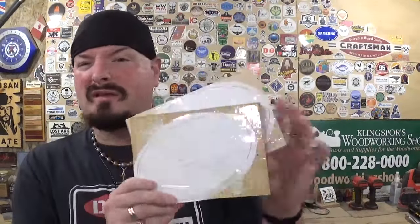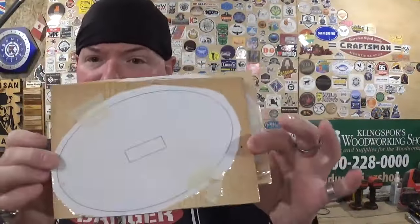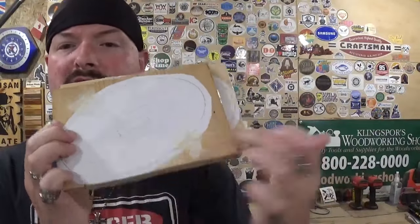The design is simplistic in nature and you can easily get out in your workshop or garage and knock this out. It's always great if you have the ability to make something handmade for a loved one. The base is going to be two pieces of pine material — three-quarter inch pine that I milled down to one-half inch in thickness — and the base is going to have a slight tiered appearance with a slot for the scroll work to go in.